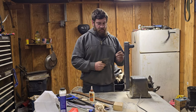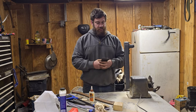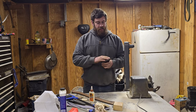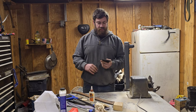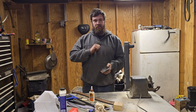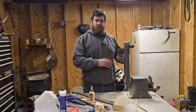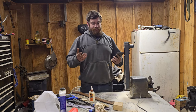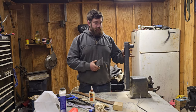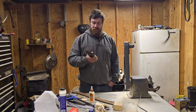Definitely getting a new belt, my god. But I'm just taking a real nice pass on it. I'll figure out what's high and what's low, and go from there. Create a burr on both sides, get it down as far as I can, get my stone, run my stone across it, run my strop across it, and she'll be done. If you have a little belt grinder, it's a lot easier. You don't have to have one. I can use a file just fine, like I've showed you. But for time reasons, I'm going to go ahead and use that. And yeah, we'll get this thing wrapped up.